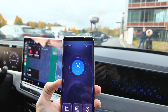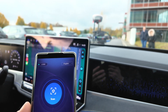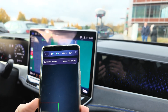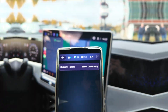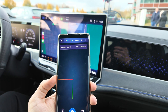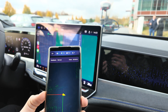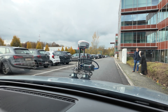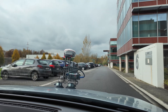We can see that we are already connected to the device by Wi-Fi. We press scan and we have to wait 10 seconds. We can see that the RTK is already fixed. Now we wait 10 seconds for the initialization. Keep in mind that for a good scan we should not exceed 20 kilometers per hour. Now we can see that it is already scanning and we drive.